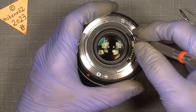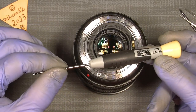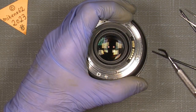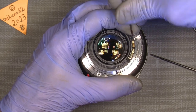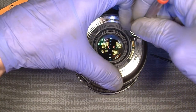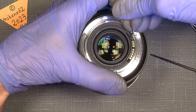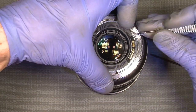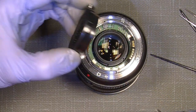You probably can do it with a thin screwdriver — this is a 2mm flat head — and we can probably come into it that way. But I prefer my dentist tool because it just works. Don't do too much to the plastic, it could break easily. Get on the side, get a little more room here, and then I can begin to lift it off gently all the way around, and then it's free.